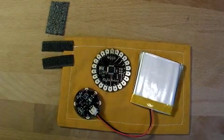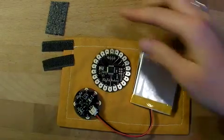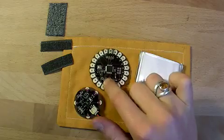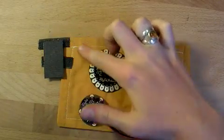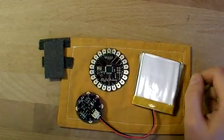The idea behind this circuit is pretty simple. I split one of the pieces of conductive Velcro into two halves, and each of these is connected — one to the power source and one to the LilyPad. When this switch comes down across these Velcro pieces, it bridges the gap, providing power to the LilyPad, which will light up a sequence of LEDs around the patch.